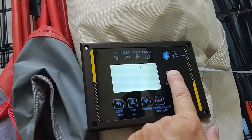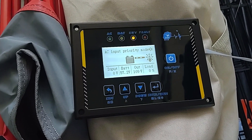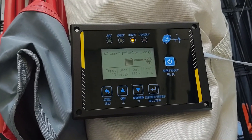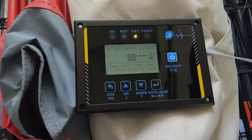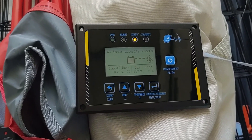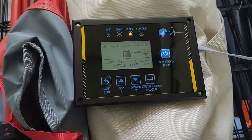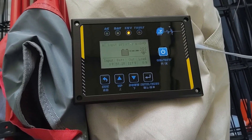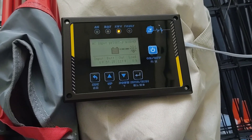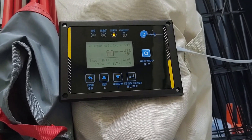Here is the panel — I'm turning on the inverter. The inverter will show you what I have. As you see right now, I've got 57.2 volts. The battery tops off at 58.8, so right now I'm at about 90% charge. I have it set to charge at 58.4 because I don't want to go over that. If I plug it in, it will show that I'm charging the batteries; if I don't plug it in, it shows I'm producing electricity. What I'm going to do now is unplug my coach from the outlet and plug it in from the inverter.